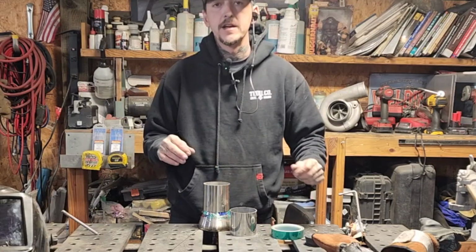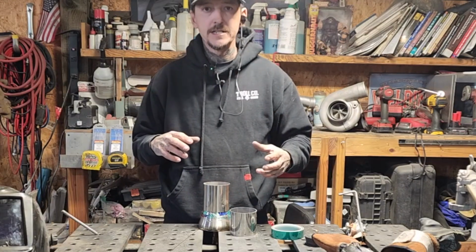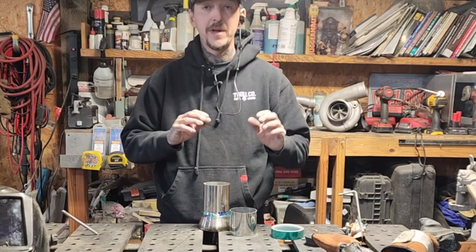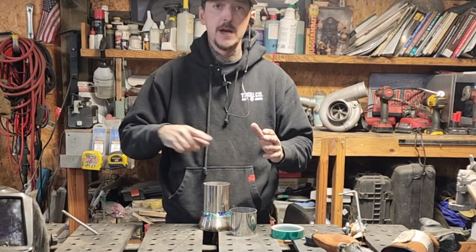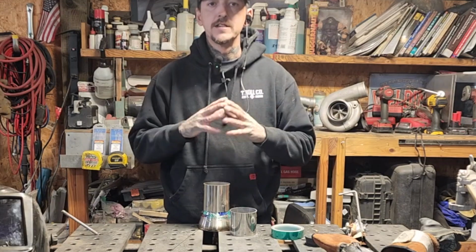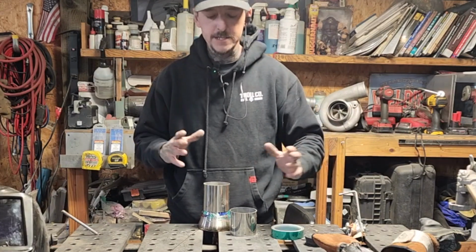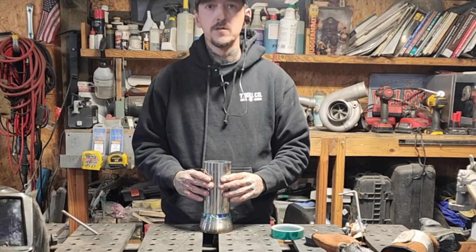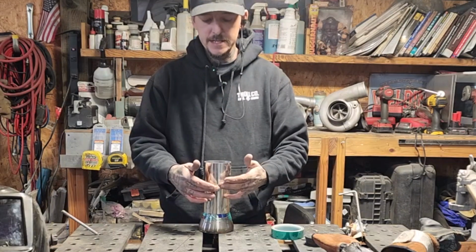And in the sanitary, like brewing and laboratory industries, it's key. I do a lot of sanitary, so not only is back purging important, but also passivation, which occurs after you're done welding. If you've ever seen the Capital Weld cleaning machines, that's all back purging in that industry. In the race car industry, we're still back purging, because what that's going to do is create a stronger weld, right? What I'm going to do here is set this up.